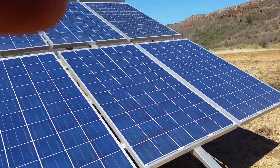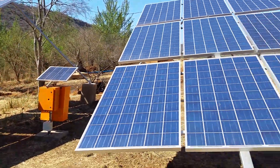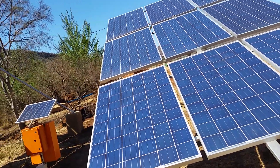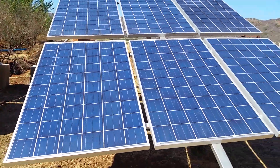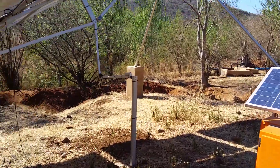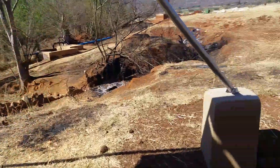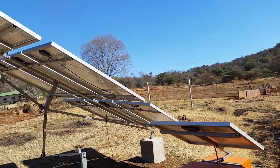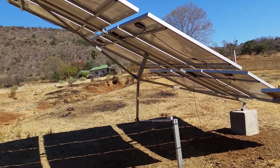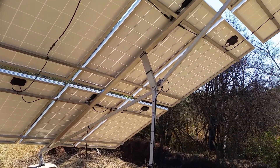So this is my solar panels — 18 of them at 245 watts, all connected in series. The sun is quite bright today so it's at maximum power. The solar tracker is still working very, very good — top quality I must say. All 18 panels connected in series give me about 540 or 550 volts.